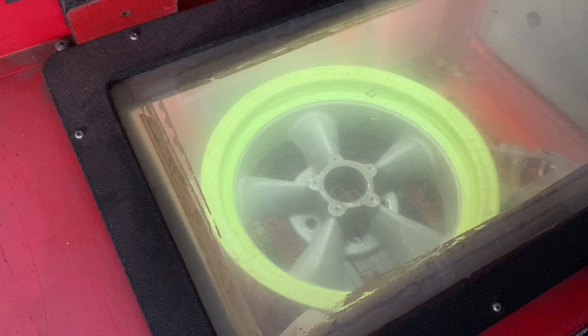What I'm going to do is put it up in the blaster - right now it's a glass bead media, which is not too aggressive for aluminum, but it'll take the paint off these wheels and leave more of a polished surface. They're going to remain bare aluminum.